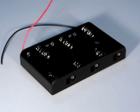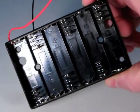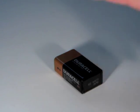The Z11 Pro 2 needs at least 7 volts to operate reliably, so a 6- or 8-cell AA or AAA battery pack is recommended. Although a standard 9-volt battery will work, it will drain quickly and is not recommended unless no other solution is available.